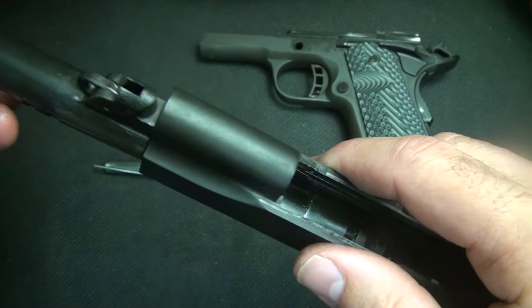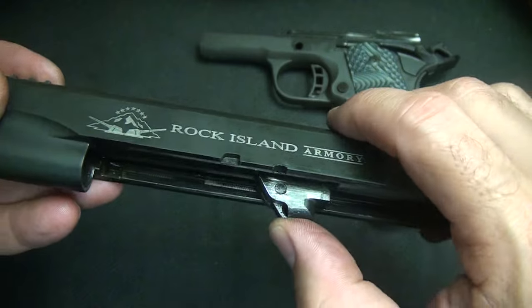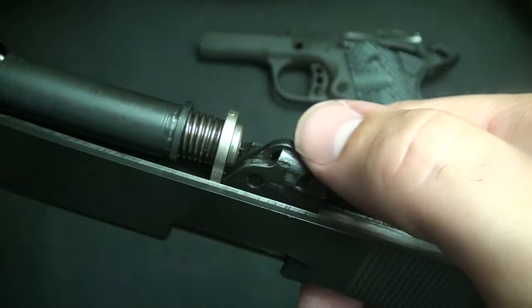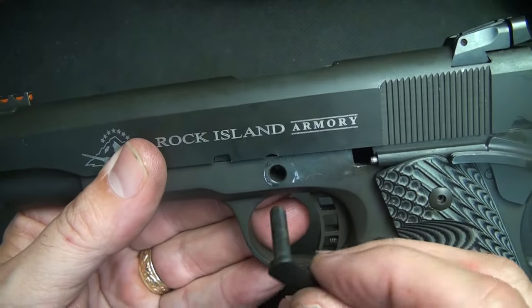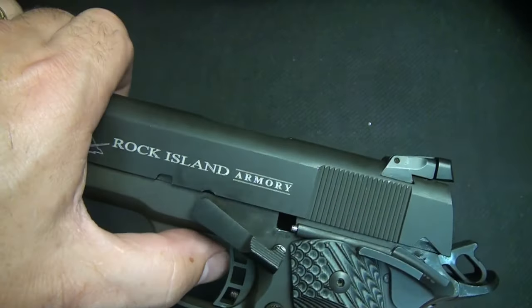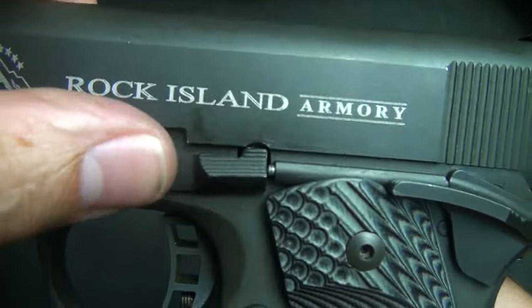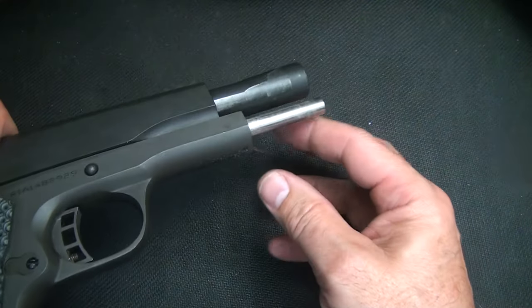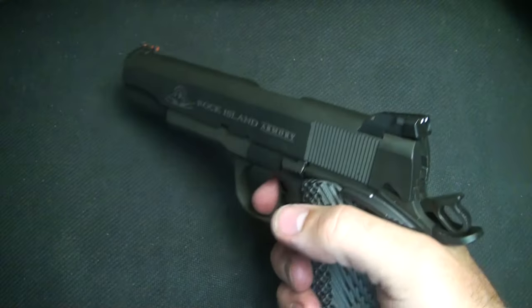Go ahead and take your barrel, slide it back through the slide with the barrel link down. Once in place, bring your barrel link up. Reinsert your guide rod — I turn it upside down and then whip it around. Bring that link back down and attach it to your slide. Once you get your slide over, slip your slide stop into your barrel link to hold it in place. Bring your slide back. With this little plunger, pop it right into place. Now bring the slide back as far as you can — that relieves the tension on the paper clip. Let it move forward, and you're back in business.